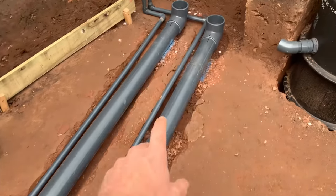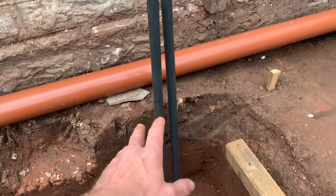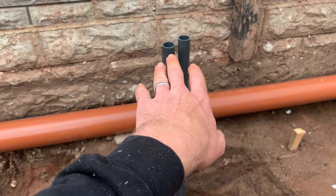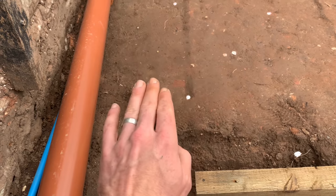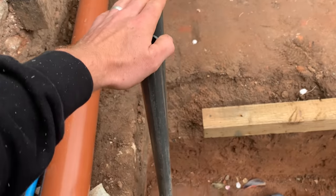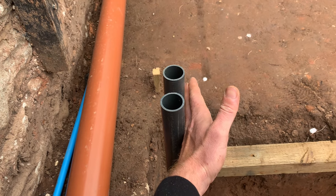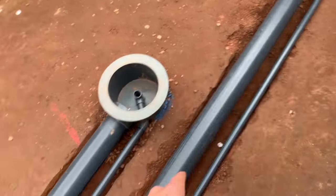These are all glued in — the 90s are glued. What I'm doing at the moment is fitting my airlines. I want them to come up in the exact same point against the back of the pond wall inside my filter house. These two pipes will come up in the exact same place, both have ball valves on to shut the air off if I ever need to. My wall from my filter house will run up through here and these will plumb dead straight against the wall so I can pin them. I've got to mark all these up now, get them all glued, and it's another job done.